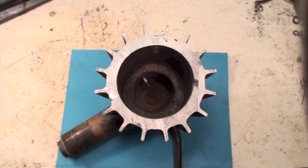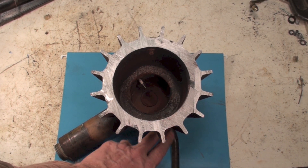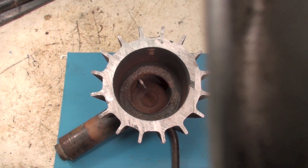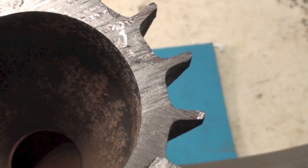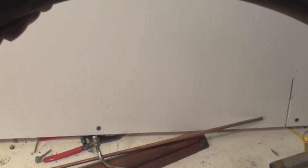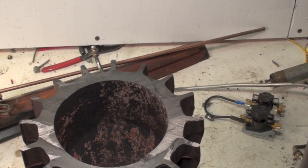Here is where the air comes in, and here is where the gas comes in, so the two come in together right there, ignite at the bottom of that, and it expands through the combustion chamber. I'll show you the top — it's nothing special — it just expands, kind of goes down a cone and out into the rest of the heat exchanger tube, then goes around to the secondary and so on. That's pretty much it for the pulse combustion chamber.